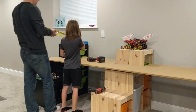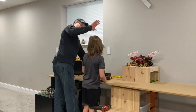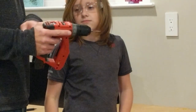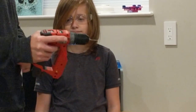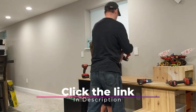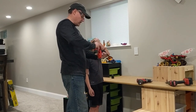What do you think half of 32 is? About 16 — I divided 30 by 2 and then divided 2 by 2. Great job. So 16 inches. If you squeeze the trigger all the way on gear one, you can see the little flutes turning. On gear two, it spins so fast you can't see them. This is the gear ratio — one is slow and powerful, two is fast and less powerful. You have to pull back to release the locking ball bearings and then pick whatever orientation you want for the offset driver.